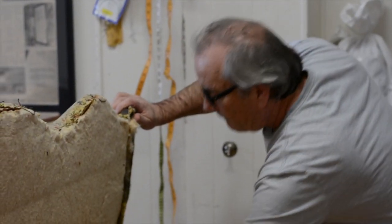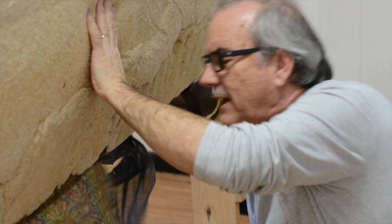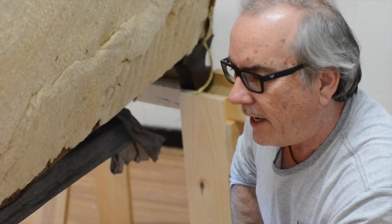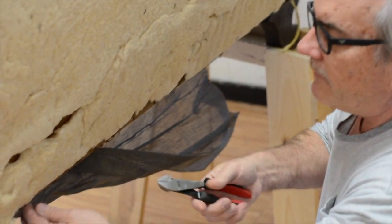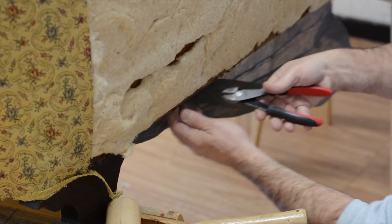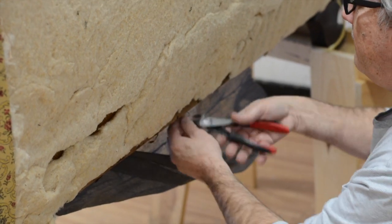This is coming off pretty well. On older fabric and older wood, the staples don't go in as well, so you can pull the fabric down like this and take it off from the bottom. I'm trying to do as sensitive a strip job as I can on this. I don't want to use a lot of heavy hammering — I want to try to preserve the piece as much as I can. Now with my fingers, I want to make sure that every square inch is stripped clean of all those old staples. You need to go and get every one.